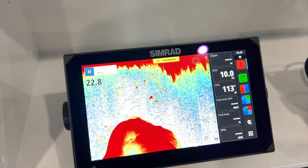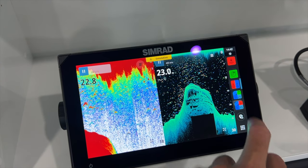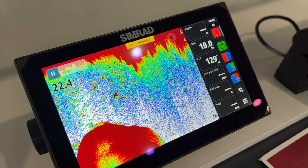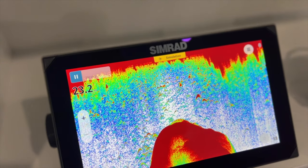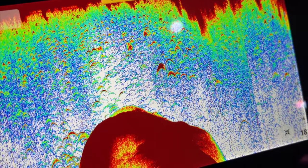These units are going to be really great for guys with limited space on their boat as well. They've maximized the amount of screen space but kept the actual head unit quite small, so you can fit them into smaller places. There's also a big improvement for guys fishing — you can get a single channel CHIRP transducer, or a normal 50 to 200 one kilowatt unit, and run it through these. This is a big improvement for guys looking for a budget sounder or chart plotter, as you can get a lot of benefit from running a bigger, more powerful transducer.